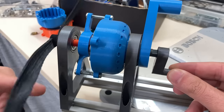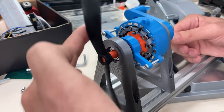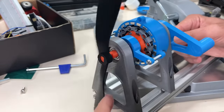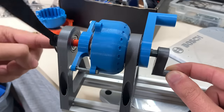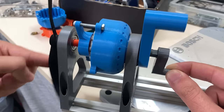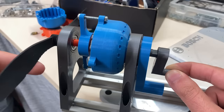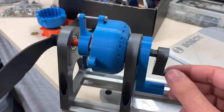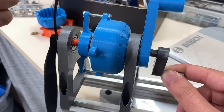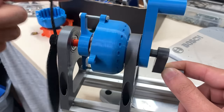When the modulator is stationary, turning the sun gear causes the blue ring gear to spin. For the ring gear to make 1 turn, the sun gear has to make 5 turns. This means a gear ratio of 5 times — in this case we get 5 times more torque than the input sun gear, but in return the speed will slow down 5 times. Notice that the gears are rotating in opposite directions.